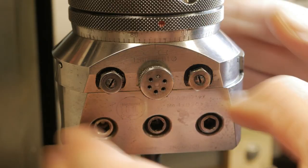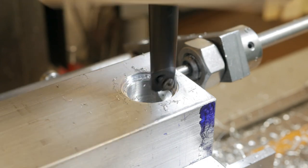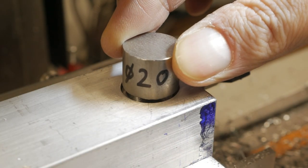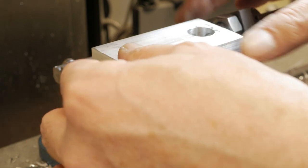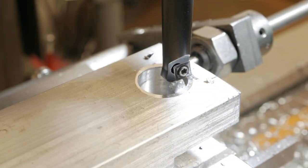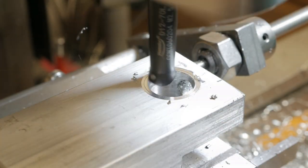The effort in rotation would certainly have been supported by the aluminium. Furthermore, given the manufacturing, the aluminium would give me the possibility to work it in a short time. I fixed the bushings with strong Loctite, the one used to lock the bearings.